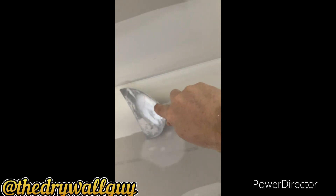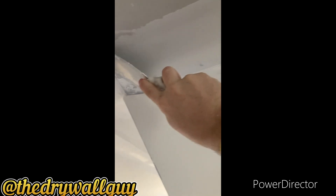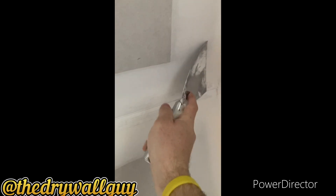So now our inside corner 45 degrees is completely dry. So now what we want to do is scrape everything. These little holes are made to make it stickier, so sometimes there's mud coming out of the hole. I just want to make sure you scrape everything — make it nice and smooth. So now that it's all scraped — or you can sand it also if you want — I just scrape it like this after the first coat.